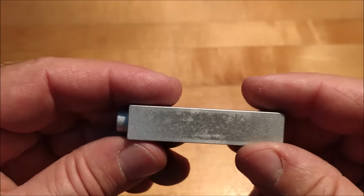This is called out as .125 deep. I will probably go .135 to here. It doesn't matter if it's .132, .135, whatever, so long as when the T-slot cutter engages, it's only cutting on the very edge. That'll reduce the risk of snapping that off. Absolutely. That's the plan. Let's pop it in the machine and make that happen.